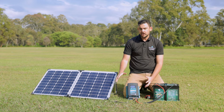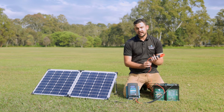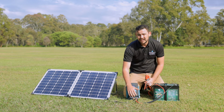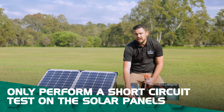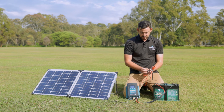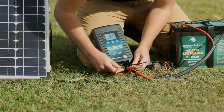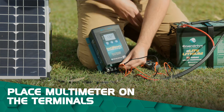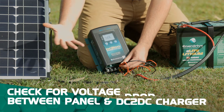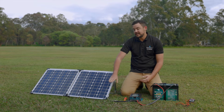An easy way to diagnose if your solar panel's not working — just grab out your multimeter and we'll do a couple of tests on it. We'll test to make sure that we have got voltage at the bottom of the DC-DC, and then we'll do a short circuit test. It's critical that you only do the short circuit test on the solar panels themselves — if you do it on anything else, you'll potentially damage other components in the system. We'll switch our multimeter onto volts DC and put it on the terminals. On the multimeter and also on the DC-DC, we're getting the same voltage reading, so we know the voltage is correct and we're not getting any voltage drop between the panel and the DC-DC.